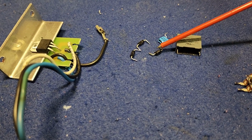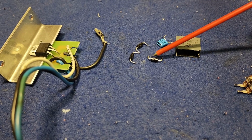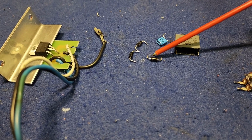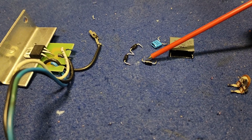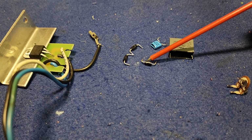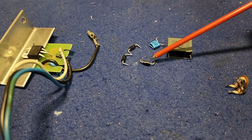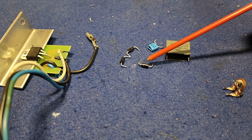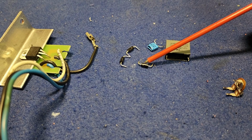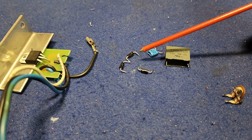And they are essentially another AC switch, a bit like the triac, but these ones are triggered by a certain voltage. Now the DB3 is the actual part number, and the 3 indicates 30 volts, which is approximately the voltage across them which is required before they switch on. So until it gets to that stage, they show as open circuit. So they're actually testing out fine.